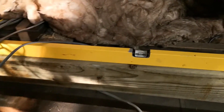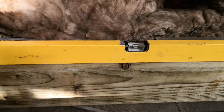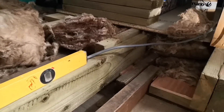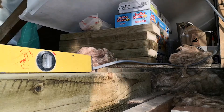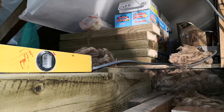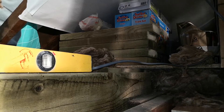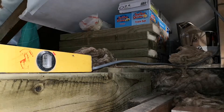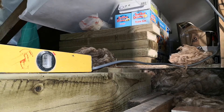Okay, we've got the first joist in place and threaded it under all these electric cables. You can see it's obviously level, which is good. Just setting the camera down and we're going to fix it into the central packer plate and also attach it to the other joist coming across from the other wall just to give it some stability.